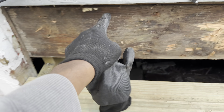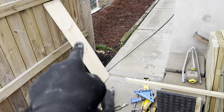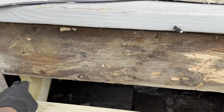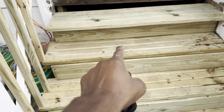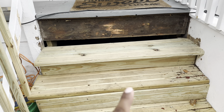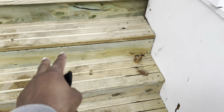Starting to see why they did what they did. This piece isn't wide enough, and in order for me to put the one by ten here and secure it with a screw, I need a strip of wood to go across there. Not only did I get the strip I needed, I bought some one by sixes and I'll remove the two by sixes. I just need to put that strip there and carry on. What do you guys think? Be honest — leave your comments in the comment section.